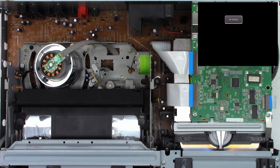So it's going to get folded down and over like that, so it doesn't occupy a lot of real estate. Always make sure that these are folded flat. That looks good. And then this one is the audio control erase head, the full erase head. Okay, I'm pretty happy with those results. We need to service the prism next, which is quite easy to do.